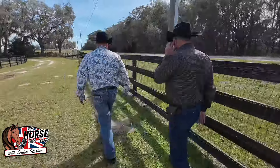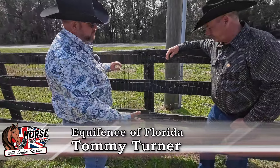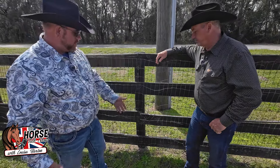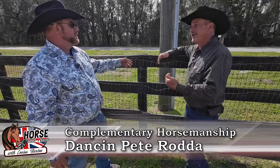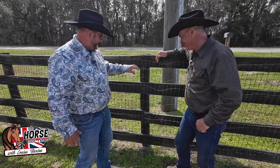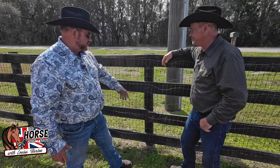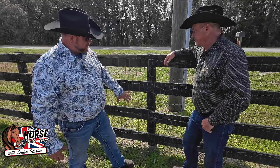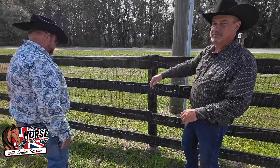Right here is another reason why we don't put wire over the top of boards. Not to say you'll never hit wire that's behind a board, but mower decks are infamous for grabbing wire — this is a very common problem. By putting the wire behind the board, you're helping to protect it. Of course under the board you'll still have exposed space, but if this wire had been behind the board, the chances of this happening would be greatly reduced.